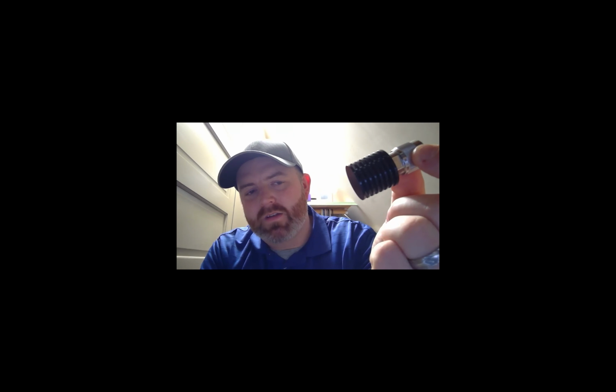Well, before the next question comes in, I want to take a moment here. For a lot of people that have a lab and they're testing out their products, hooking up to antennas, that's okay if you're turning the power down and things like that. But I would encourage you, if you have a lab environment, and I'll post a link to these on our Facebook page, if you are on there, great, you'd see that. These are called dummy loads. Take a good look at it. This one's actually good for 10 watts TX power. But they make some for 1 watt, and I would encourage you to get your hands on some.